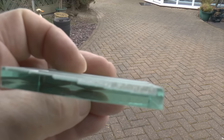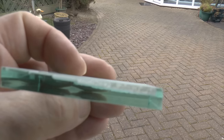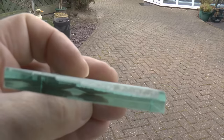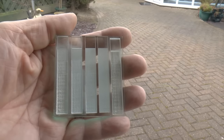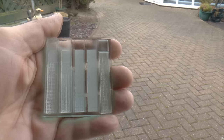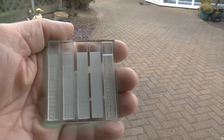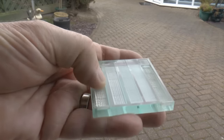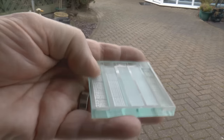We can certainly see that we've got big steps between step 1, 2, 3, and 4. Then it tends to get a bit messy as we get to the last two blacks. They're certainly very messy. They're not very clean cuts, except when we're going very fast. That may be to do with the line spacing and my lens. More experimentation required there. So I think the first one was probably the most successful one. Linear range, slow power.